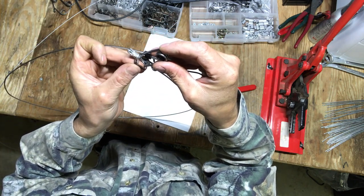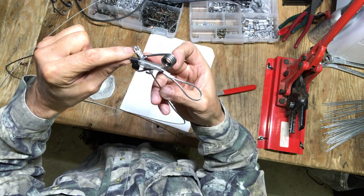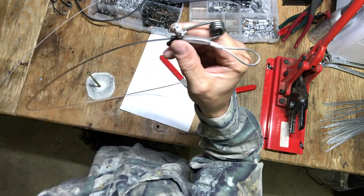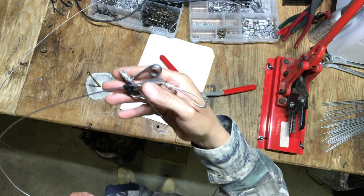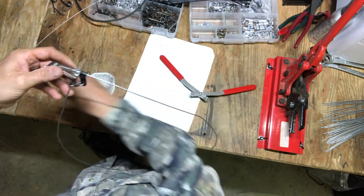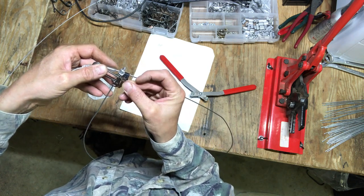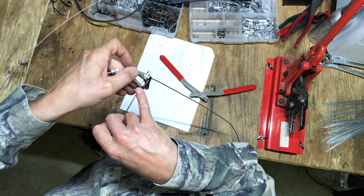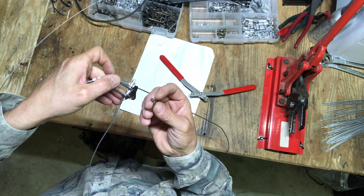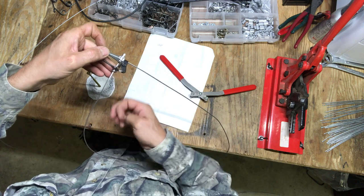With this trigger — which is what you would be doing — it would just be on this side of the cam. But with the trigger on the way I've shown you, between the breakaway and the spring, you're always going to find it on the same side — it's always going to be set up like that. If you take this trigger and put it on the other side, you're not going to put it here, because then the trigger is going to bite on the end of the spring eyelet, you're going to get spring twist, hair trigger action, and this thing is going to go off and snap you.